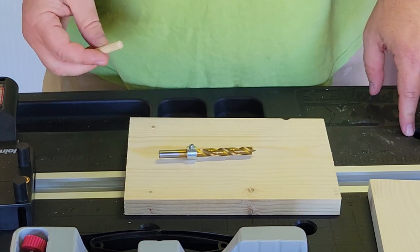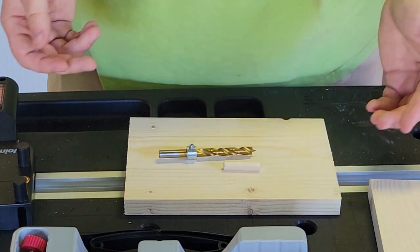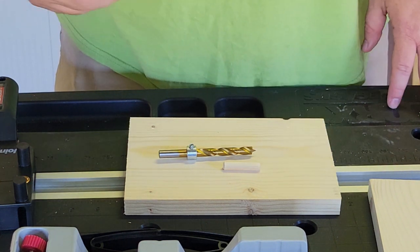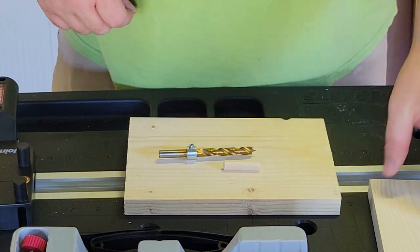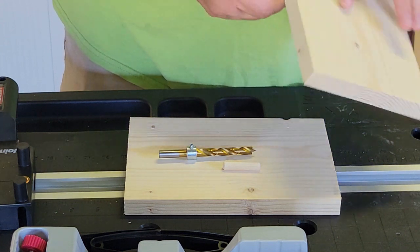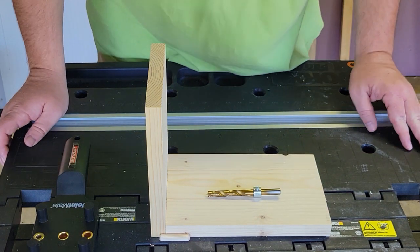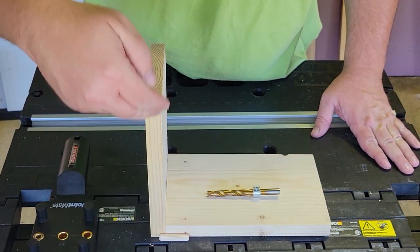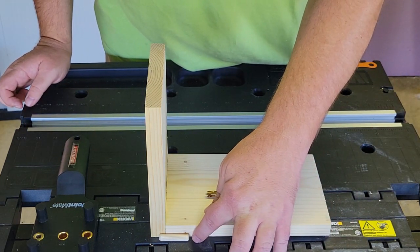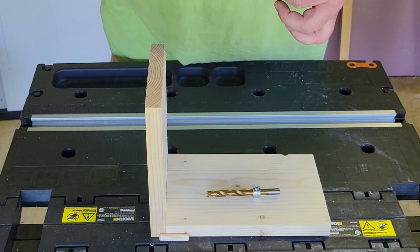Setting up the depth on the drill bit can be a little bit tricky with the corner and surface joints. If you're doing edge joints, you just take the length of the dowel — in this case it's an inch and a half — divide that by two and go a little bit deeper so you have space for the glue. Here we can't do that because it'd be three quarters of an inch and it'd be going all the way through. So after doing all the calculations, we want about three eighths of an inch going into this piece and one and three eighths of an inch over here. I got the drill bit all set up. Don't forget to account for the inch that the jig is.